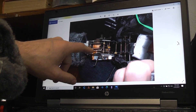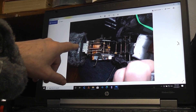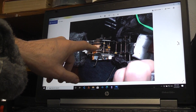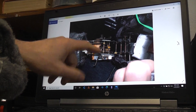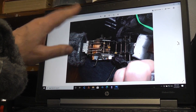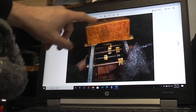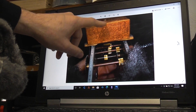Looking from the back side — the motor fits in here, and here's that brown box we saw from the front: the sounding board for making the gorilla sound. There's a cam right here that when things are running opens and closes the mouth, but that cam also pushes on a lever which moves the screecher — a metal finger that comes off the sounding cardboard box and rubs against a gear. When the mouth is closed, this metal finger on the cam pushes that away from the gear so it can't make a sound; when the mouth is open, that lifts out of the way so the screecher arm does hit the gear to make a noise.